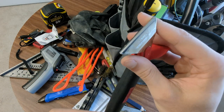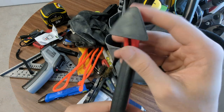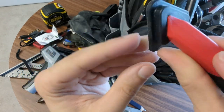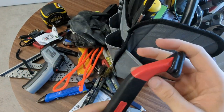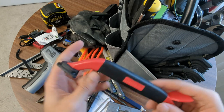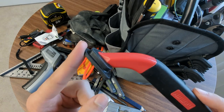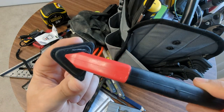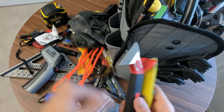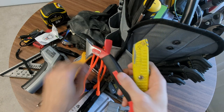This is a caulking tool. It helps scrape up caulking, apply caulking, and kind of spread it around. This has adjustable rubber heads - you can pop this off and adjust to any of these tips you want. I actually typically just put a disposable rubber glove on, dip my finger in soapy water and run it, and that bead of caulk is awesome. But sometimes in tricky places when you need a little bit more delicate, professional look, you can use this. Not expensive, definitely worth it. In conjunction with these three things, you can pretty much do any caulking removal or re-caulking.